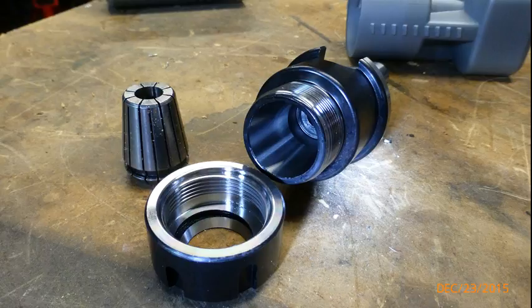So this is where we're up to: we've machined the shaft and I've made the shaft a little greater in diameter than the original so it's a tighter and nicer fit on the milling cutters, and we're now faced with machining that NT30 taper. What I thought I'd do is set the compound on the lathe across, and in order to do that the easiest way from my point of view is to measure an existing taper. I didn't want to use the one off the old shaft because that's a bit damaged.